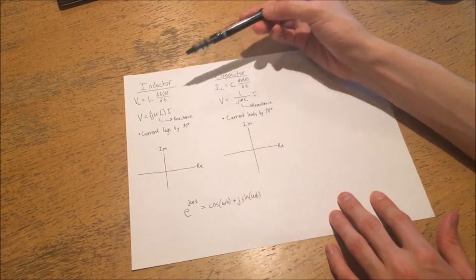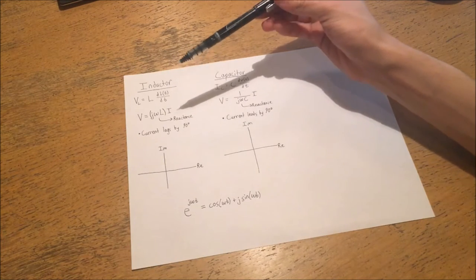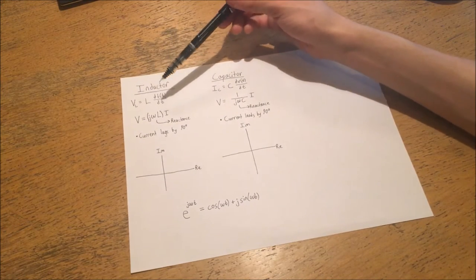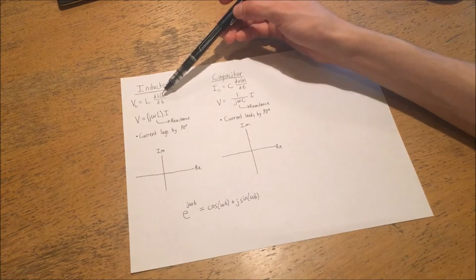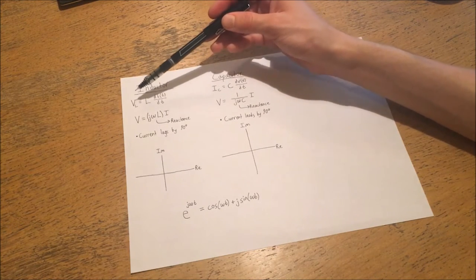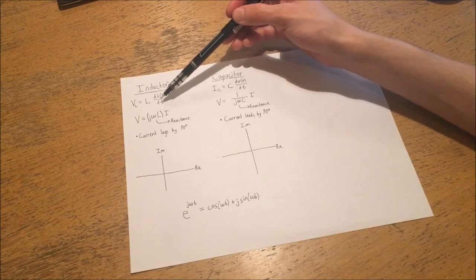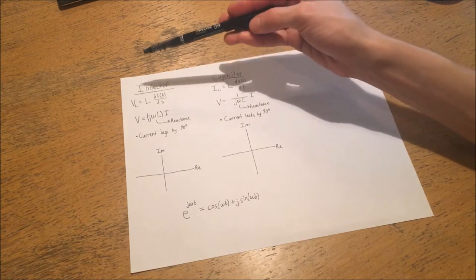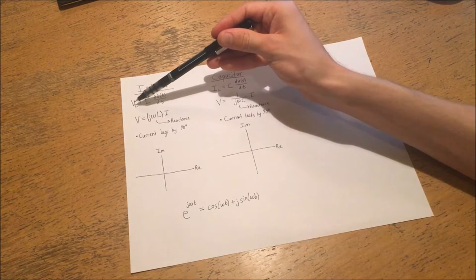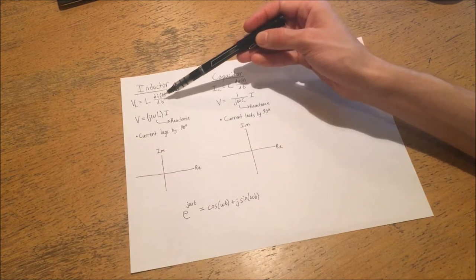The first thing I want to introduce is the relationship between voltage and current for inductors and capacitors. For an inductor, the voltage across it is proportional to the derivative of the current through it — that is, the rate of change of current multiplied by the inductance L equals the voltage across it. What that means in simpler terms is if the current is being forced to change rapidly, as in an AC sine wave, and there's a considerable inductance present, the voltage is going to tend to oppose that change in the other direction, effectively fighting that change in current.